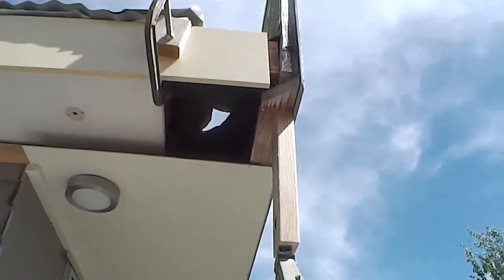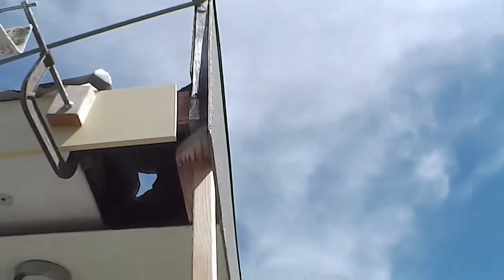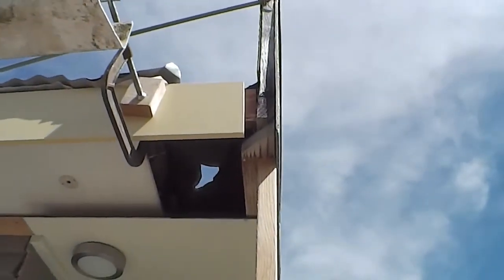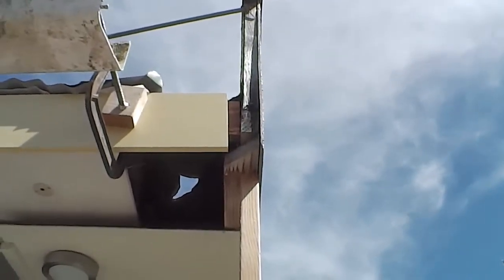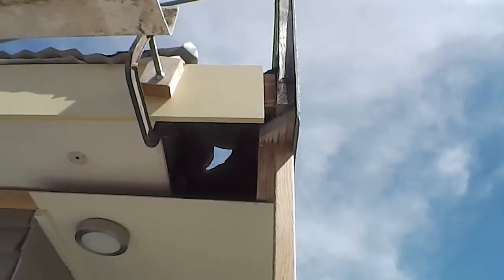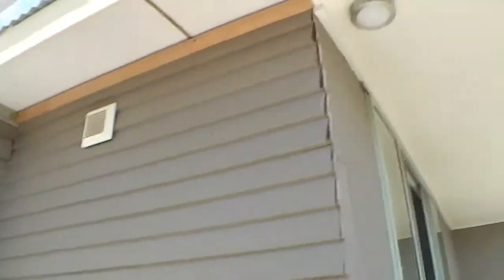Let's put my barge board in, slide it back this way and get it all nice and set and level. Then I'll put three, four, maybe five or six nails at this end and then I'll just put a few along the way to make it all nice and solid.